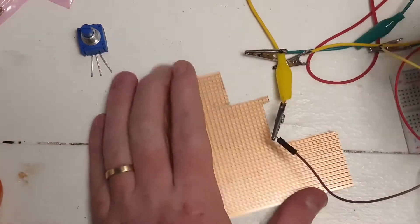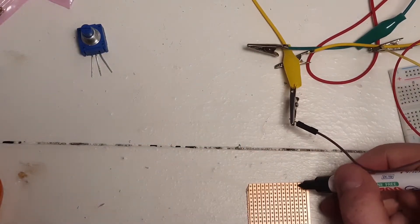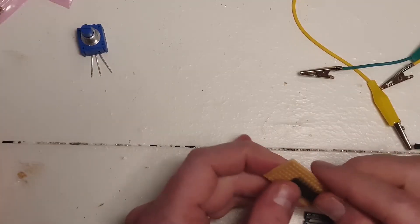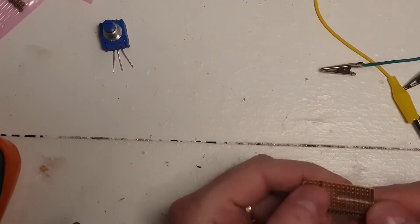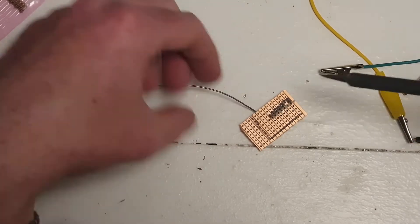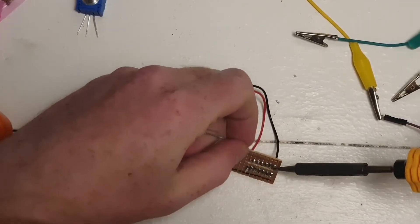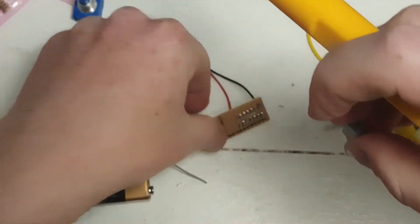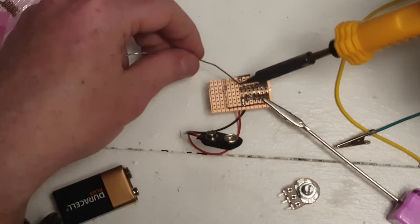After this, I was ready to move the circuit from a breadboard to a stripboard, which would be a more permanent setup for installation into the instrument. I marked out how big of a board I needed and then cut it down to size. I test-fitted the IC and then scored all the strips in the board to make sure I didn't short the chip, and then soldered the chip directly to the board. I then connected a 9V battery lead to the positive and negative terminals of the chip, and added the 1uF film capacitor which connects the inverter to ground. I also added the 20k ohm resistor to act as the base resistor dictating the lowest note.